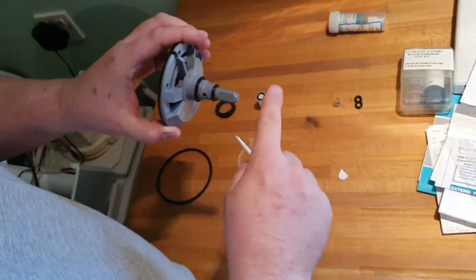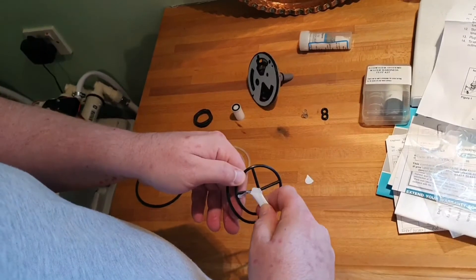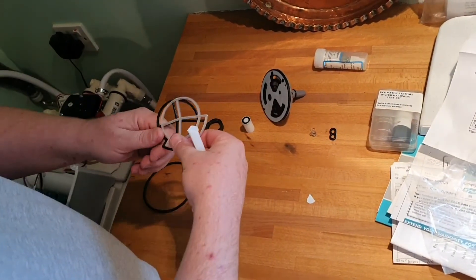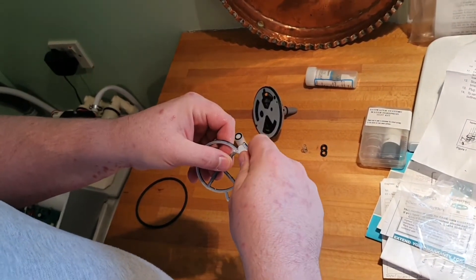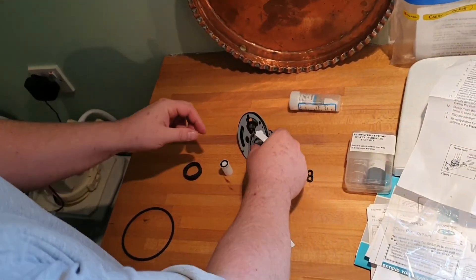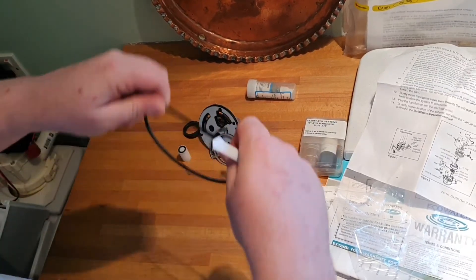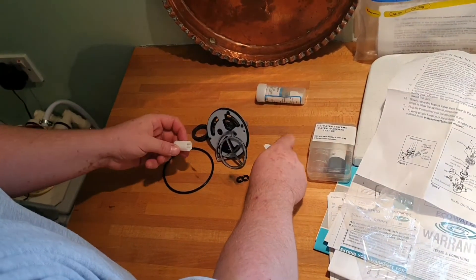On the disc it's got a teflon coating on the front, and that's the face that runs across the wearing strip of the spider gasket. This is the spider gasket — let's put some silicon on that. It's called a spider gasket because it looks a bit like a web, and this neoprene gasket gets covered with a wearing strip which sits on top. Silicon grease on there as well, which prevents any friction and wear. We'll next use the figure-8 o-ring, put silicon on there, and then using the excess on the fingers we'll put it around the main o-ring which seals the valve head to the body.